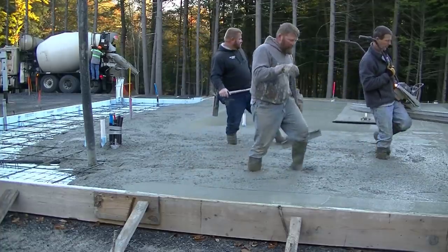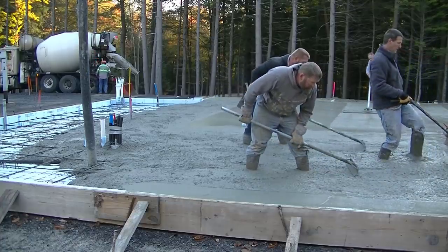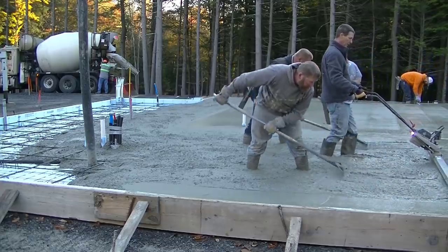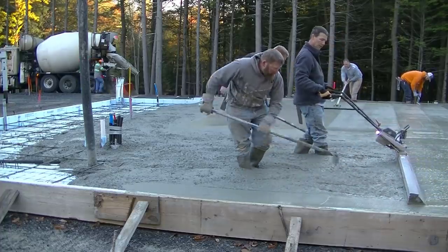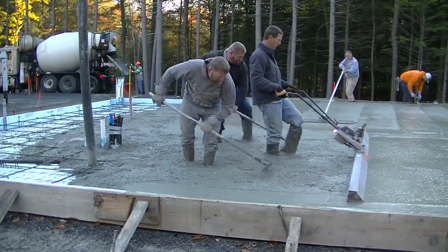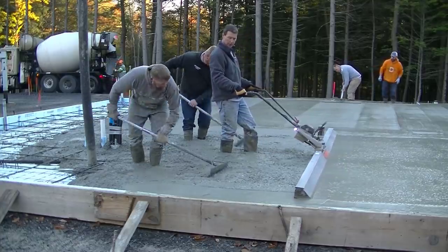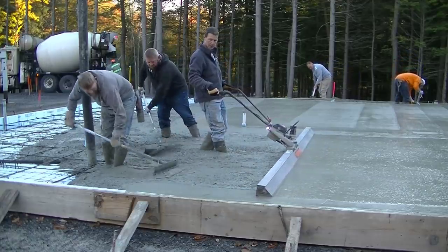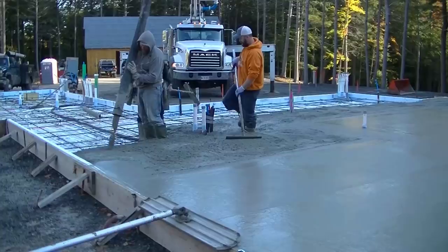You can see me walking there, dodging the rebar and those big black pipes sitting on top of the radiant heat — definitely don't want to twist an ankle. The guys raking just want to keep the concrete a little bit higher than grade behind the screed. That's the key: making screeding easy, filling in footprints. You don't want any low spots, but you also don't want to be pulling back too much. If you get it too high it'll vibrate underneath and you'll end up with a little hump; about an inch high or less behind the screed is ideal.